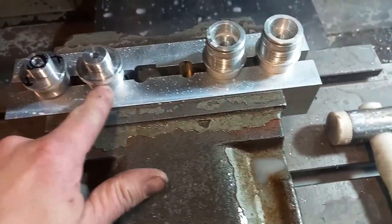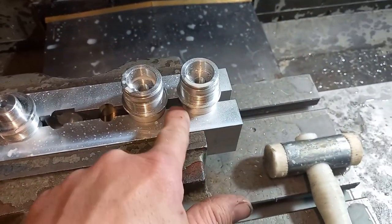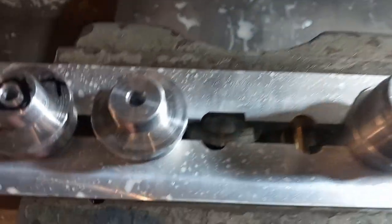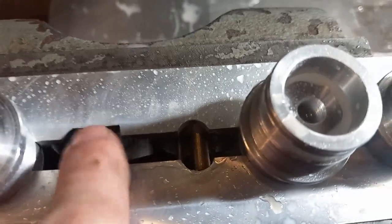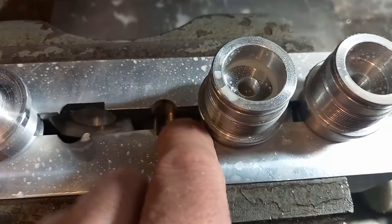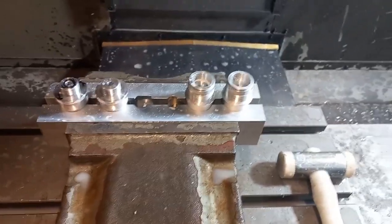Next thing we're going to do is we have a slot to put in this bottom side, and we've got a hole to put in under there. Before I did this bit, I machined a hexagon in there, which is for those, and then just a 31.8mm bore at this side so we can hold these ones in there. So we'll get on and get those ones done.